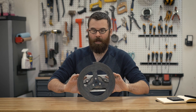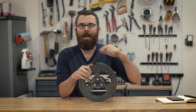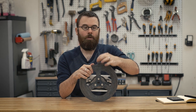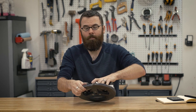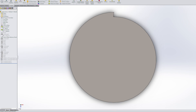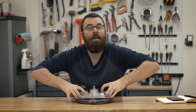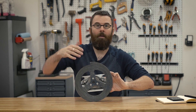If you look closely, you might notice it's kind of offset and oblong. Basically, I started with a round object in SOLIDWORKS, then did a scallop — an arc — to create a tip section on it, and then another curve on the other side to cut into it. It's almost like a nautilus shell where one side comes out and one side comes in, and that forms the actual tooth. Once you have that profile done, you can do a center of mass calculation, assign a reference point, and that becomes your center hole. All other features cascade from that, guaranteeing the center of gravity is right in the middle with no wobble.